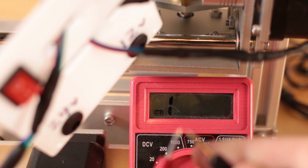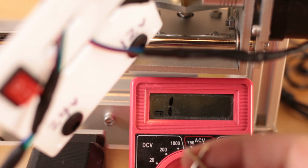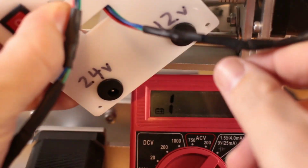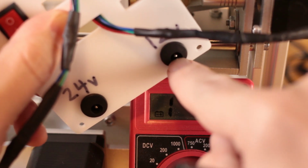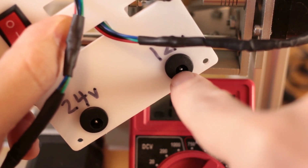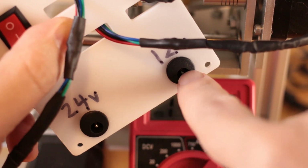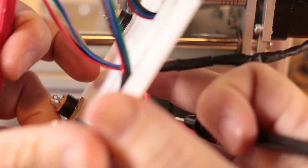Here's our multimeter set to measure continuity. You can see it changes when the two leads touch. So what we want to do here is figure out, we have our center post, and that is always the hot. That's always the positive in direct current, because they try to keep the plug from shorting, and so they make the outside the ground, so the positive can't short to anything.